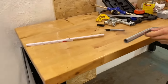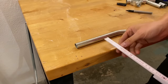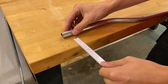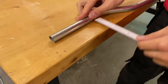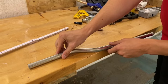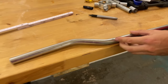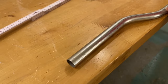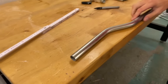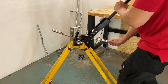So back over, reverse the process. Which one are we setting now? There are two bends — which one do you set into the correct position? I'm going to set the first bend, so I'll check that it is 50mm, because we were happy with that one. What people tend to do is do that second bend in the right position. So you're setting that back to 50mm. Yeah, you need a little bit more bend. Can you now set the second bend in the right position and show what people do as a mistake? If you set the second one running against the table — you've bent the first one too much. That's not right. What we need to do is just put a bit more in the second bend. As you said earlier, the first bend was correct, so we've got to go a little bit more. That's often what people do wrong — they think because they've bent the second piece they should check that, but the first bit was in the correct position.